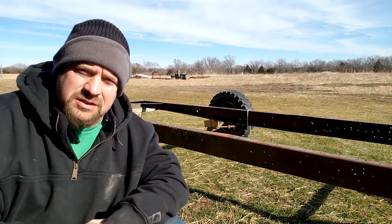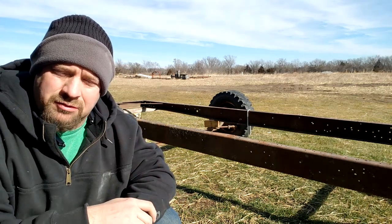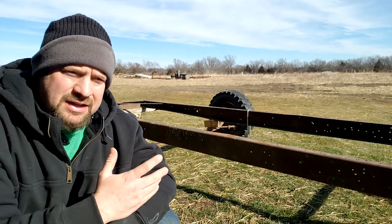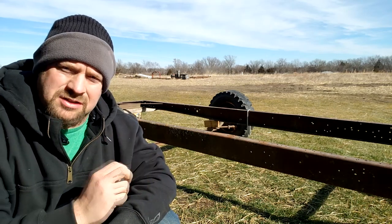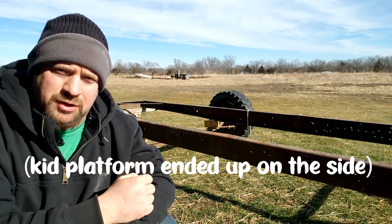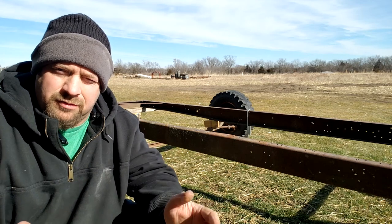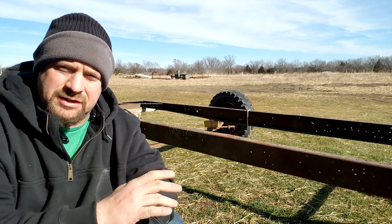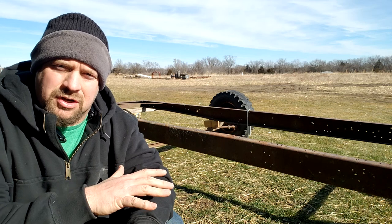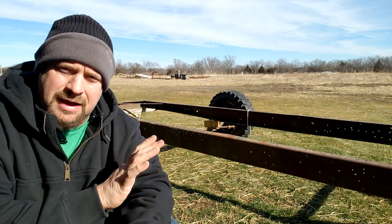Back working on the chicken coop this afternoon, and one of the things that was bothering me overnight was the positioning of the axle in relation to the front and back distance of the trailer frame. My plan is to make a platform so the kids can stand possibly on the very back of this coop and gather eggs. One of the issues was that the trailer frame came with a very centered axle. Well, I moved the axle back in order to give more tongue weight. So therefore the 3 points that touch the ground, the two tires and the tongue jack area, would be more stable. I'm looking to be able to have the kids be around this or climb on it and it really be safe and stable and not tipping backwards on itself.